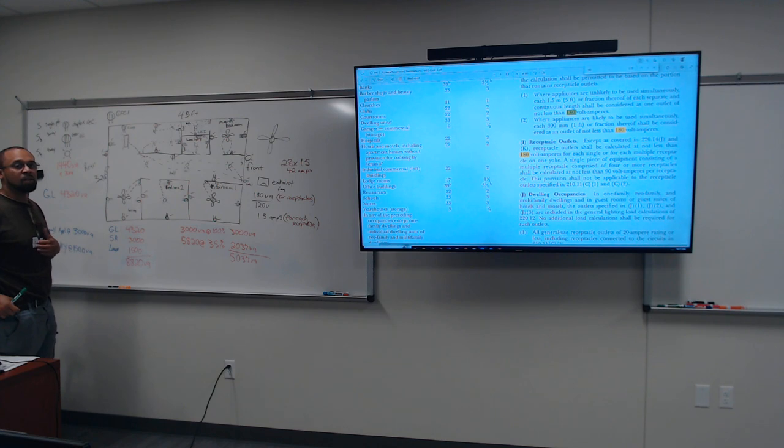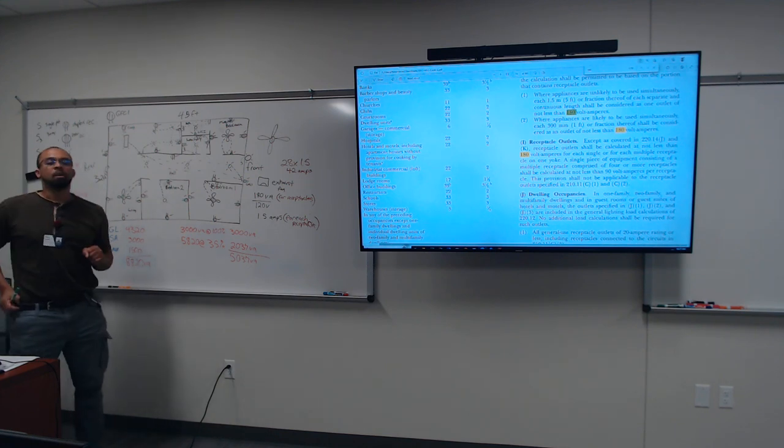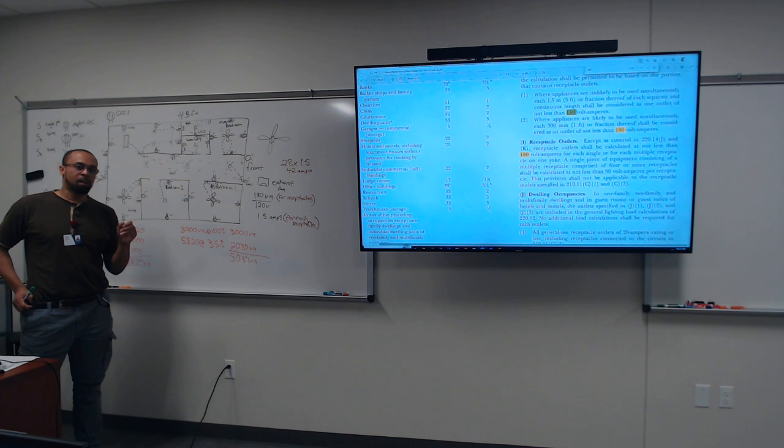Would you rather shoot above what you calculated? So say you got 42, you wouldn't want to use 45, the three 15s? Now that's the thing. Is that too close? You could. Like Cutler Hammer, all their circuit breakers are 20 amp. GE has 15 and 20 amp circuit breakers. I know Square D has 15 amp and 20 amp. But if you go with Cutler Hammer, which is Eaton, all their breakers minimum are 20 amp. Do they have 15? Yeah, they do have them out there.